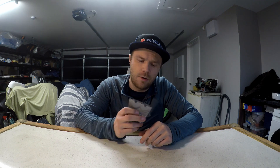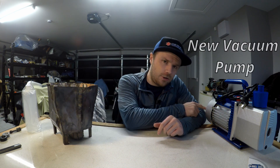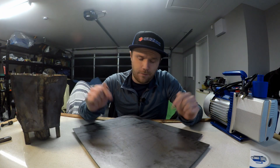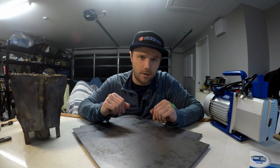I'm going to take some advice and try vacuum casting, because all of the castings so far — where they've made really interesting looking castings that are all deformed and not filled up properly — those were all done with gravity casting and there are definitely drawbacks to it. Vacuum casting I think is the way forward to get some repeatability and quality castings out of my cylinder head molds. I also need to build the vacuum chamber, and to make that chamber I have some 5mm and 6mm mild steel plate.